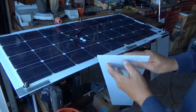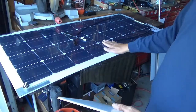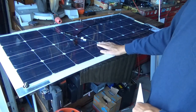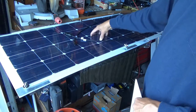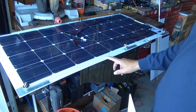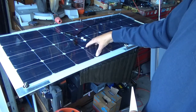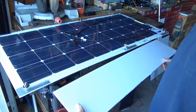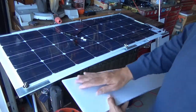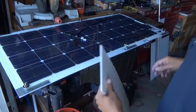What that does is it allows air to get beneath the solar panel, because what people have been having problems with is that these things obviously get very hot. They get hot and either they'll burn out a cell, or they get hot enough underneath that they damage the roof of your RV — or in my case the Volkswagen. They damage the fiberglass roof, so we're going to put a layer under there that's going to allow some air to get underneath the panel for cooling.